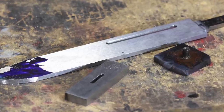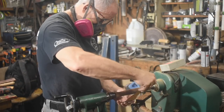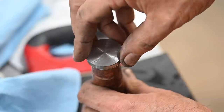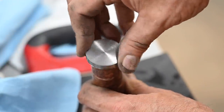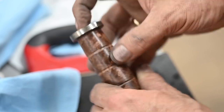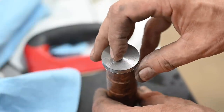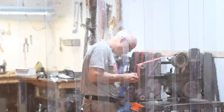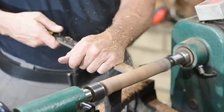There are a lot of potential problems here. If the threaded insert nut is non-concentric, doesn't stick well, or is canted slightly off axis, nothing's going to fit right. So I'm leaving extra material on the outside of the pommel so that it'll be shaped to fit the handle rather than trying to make it all perfect right now. Eventually I turned it on a lathe. As it turns out, the brazing material didn't hold up very well, so I ended up having to weld on a nut — welding isn't exactly a precision science, so the whole thing wasn't very ideal. It worked out okay, but it was a lot more complicated than I initially anticipated.